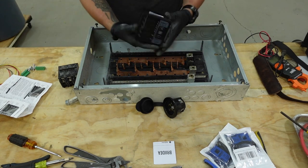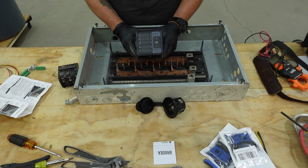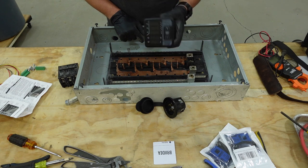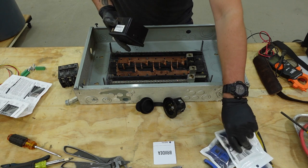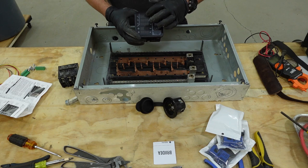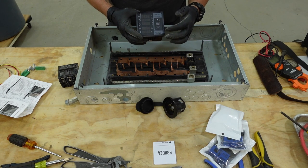I also have this thing, which is really cool, and I gotta set this thing up. This is a three-phase monitor. I found this on Amazon or eBay somewhere. It's crazy. I literally typed into Google exactly what I wanted to exist, and here it is, from the magical lands to the east. You connect voltage, and you connect these current transformers, and it gives you a full readout of voltage current on each leg, the time the things run, the frequency.